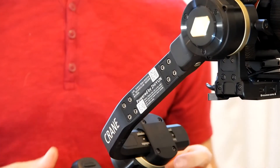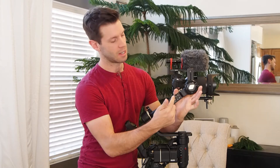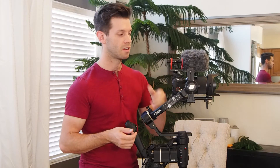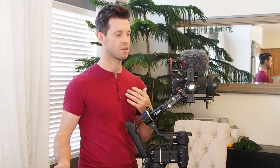Now this thing should be perfectly balanced. I did one extra adjustment I didn't show on camera — I double-checked the balance and had to tweak this motor up a little more at this joint. I loosened these three cap screws a quarter turn and the other one a little bit so there was still some tension, then tweaked the motor up in this joint with my hand and re-tightened them. I was able to do that all myself without the help of another person. There is now a tiny gap down here, and that's all it took to balance this gimbal.